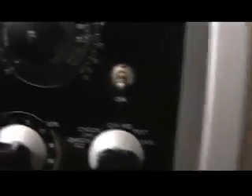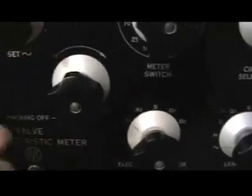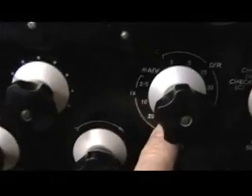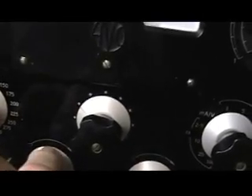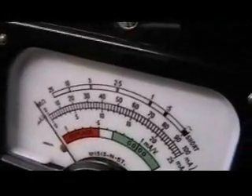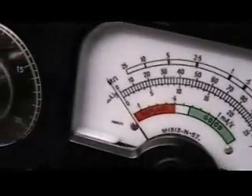Final test. Switching back now to milliamps, 100 milliamp scale, and reset the backing off. These always have to be anti-clockwise when you're measuring current through the valve, otherwise you get a false reading. We're back to 34 milliamps again. Final test is for gas — switch to gas. No grid current. So that's the last test — it passes.